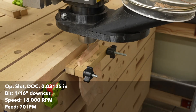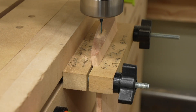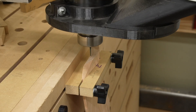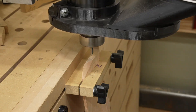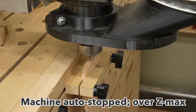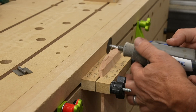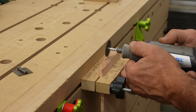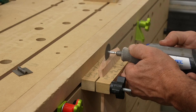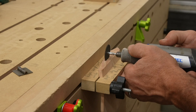I could then go and machine out the slot. I used a one-sixteenth-inch down-cut bit — an up-cut bit would have been better, but this was all I had at that time. The first time I did it, it wasn't aligned quite right and didn't go deep enough because my Z-axis didn't have enough travel. The way I solved that for future ones was just to move the piece up higher. For the one that didn't go deep enough, I used a Dremel disc to Dremel it a little bit deeper — that did make the hole a little sloppy, but it was good enough.